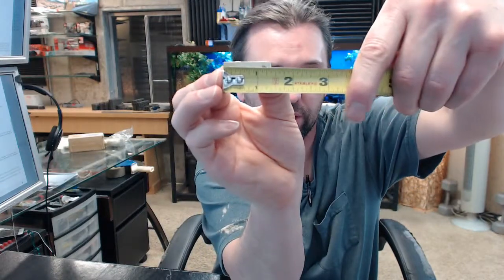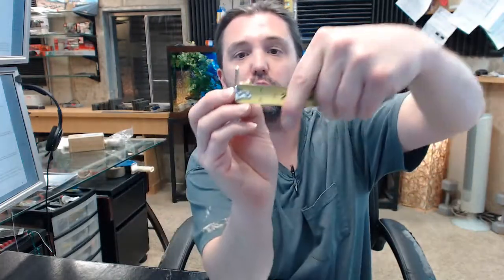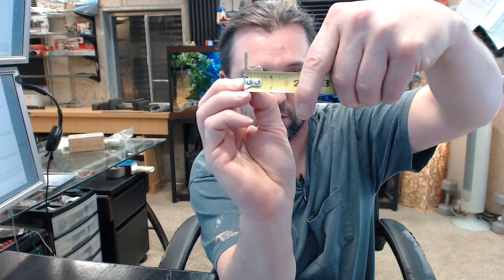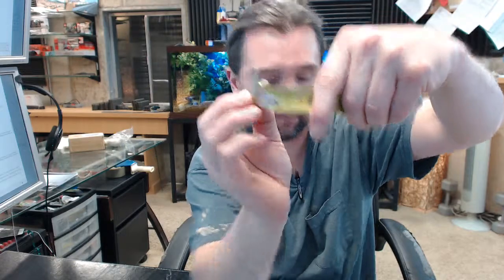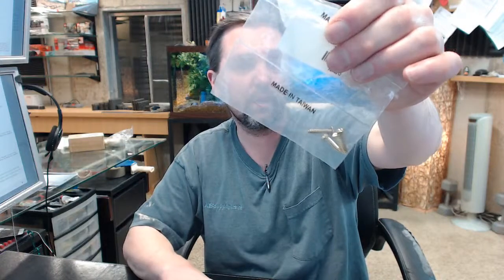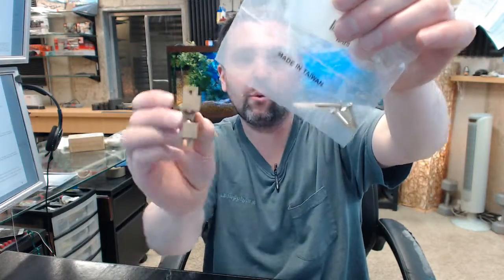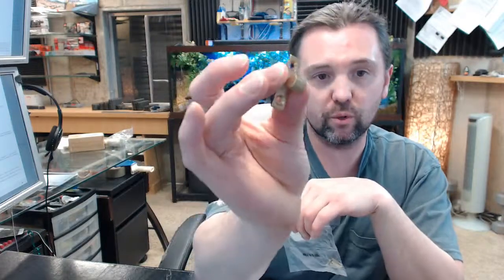That strike: overall length about an inch and 3/8ths, width about 3/8ths, then a total projection about 11/16ths or 5/8ths. Screws are included in a complimentary finish — you are going to get two larger pan head screws for the body, which is not countersunk, and two flat head screws for the countersunk portion, which is the strike.